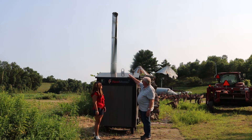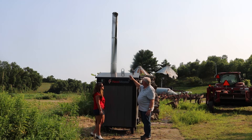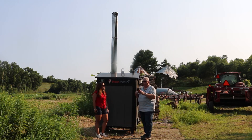This stove comes with a stub that sticks out of the stove. I like to see at least one other chimney section on top of that. This one has two, so we keep the smoke away from the yard a little bit more. But after that, we don't like to have any more on there if possible, because then you've got to frame them up and guy wire them. On the chimney cap — with dry or semi-dry wood there's still 15 to 25 percent moisture in most of the wood people burn. As the stove burns the wood, it gives off unburnt wood gas and smoke with moisture in it. When it's extremely cold, that moisture goes up the chimney. If there's a cap on it, it hits that cap which is cold, and it'll condensate and rain right back down into the stove. So it's best to operate them without a chimney cap when running.